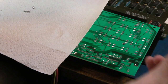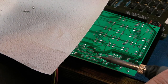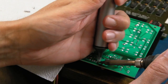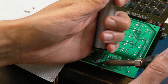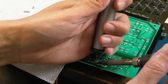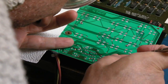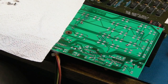And I'm not sure they have the same through hole stuff going on. What I mean is, on a good quality board you'll have a through hole on each one of these DIP pins. It goes all the way through, and I'm not sure these have that. It's like two separate layers, and if you don't get the solder on both sides, you don't get a joint on both sides. I could be wrong. That's it, I think. So I'm going to install a socket here.